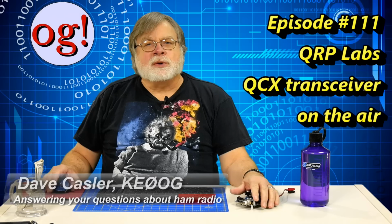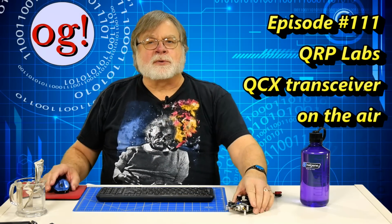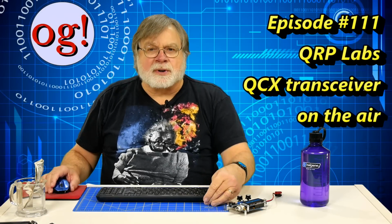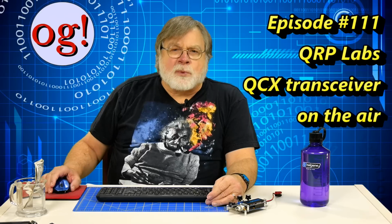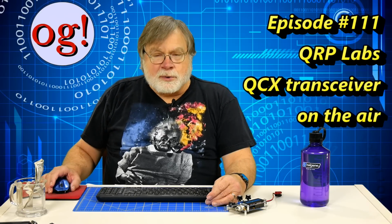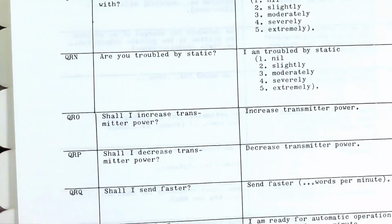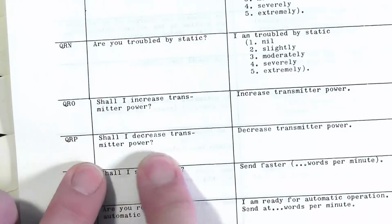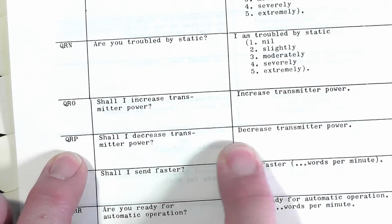Let's revisit the QRP Labs QCX HF rig, this time from a purely operations point of view. The QCX is a single-band 5-watt QRP CW-only radio from QRP Labs. QRP is an age-old Q signal that has to do with lowering power, and in amateur parlance, QRP on HF is 5 watts or less.